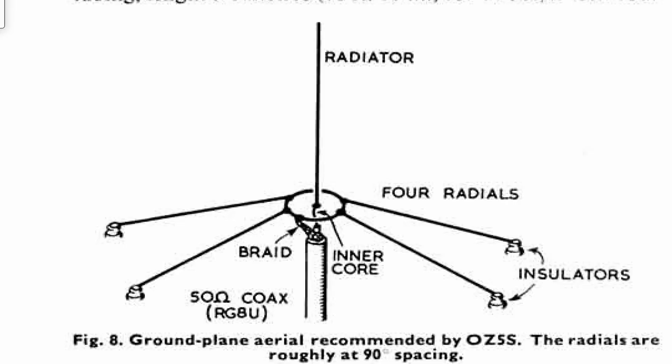But where do you put it? The way we used to use a vertical was to put it up in the air. The favourite place was on a roof or the end of a ridge, and you'd run the radials down the roof, laying them on the roof tiles or slates because they were insulators — and it worked very well. We used to run them down the roof at an angle of 45 degrees if possible because that would give a good match with 50-ohm coax cable. There was actually a warning from one of the manufacturers: don't try to mount this antenna on the ground unless you've got no alternative. Well, we seem to have reversed that now.